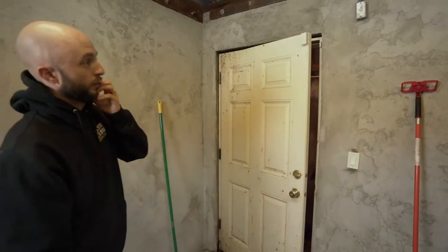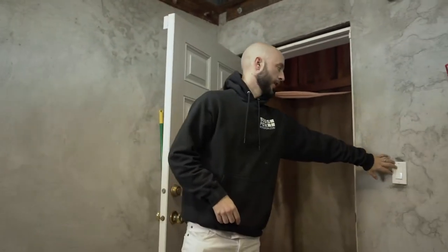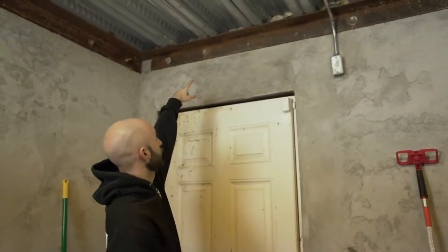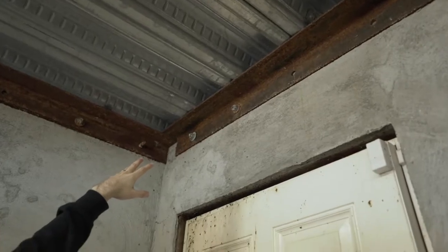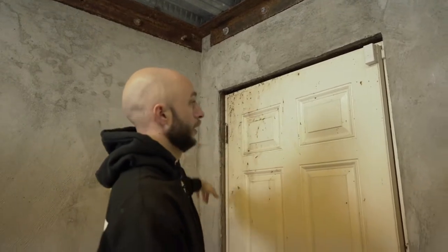The first thing we're going to do is probably just knock off some of this dirt off the wall. We don't want anything between the wall and the paint. You definitely want to take your time to pull off all your electrical boxes. Up here we have some corrugated steel — we're not going to paint over that. We don't want to seal in any of these bolts, so we're going to keep our application just to the concrete.